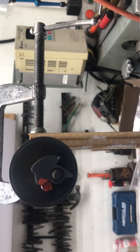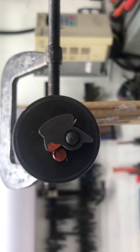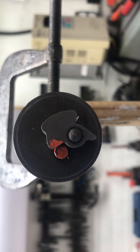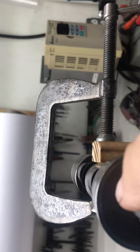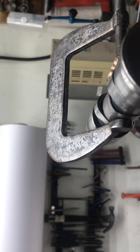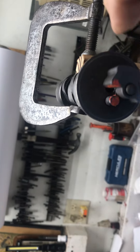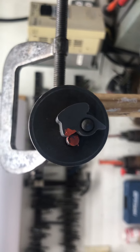When the engine is finished and perfectly functioning — when your engine is off or being rotated by the pull cord or starter motor — this little cam must always be forced up against this dowel pin. If it's floating in the air, it's no good and it's not going to actuate and keep that ball trapped in the out position. That's very important. When the motor is at rest, it should always be up against that dowel pin exactly like this.